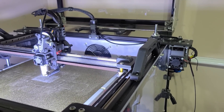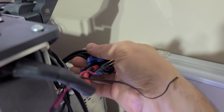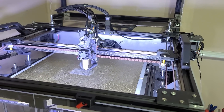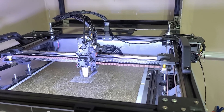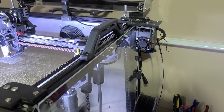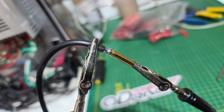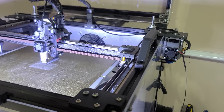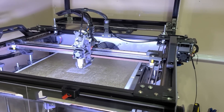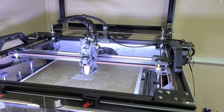For wiring on my side, get yourself good wires for the motors. I've used gauge 12 — they're big, flexible silicone wires. I chose gauge 12 because I'm running a lot of amps, with the motor set to a 60-amp limit. The electrical connectors that come with the oDrive motors are big and gauge 12 fits really well. I wouldn't go lower than gauge 14. You'll also need at least four wires to connect the step and direction pins.